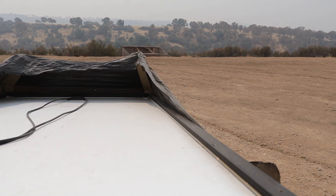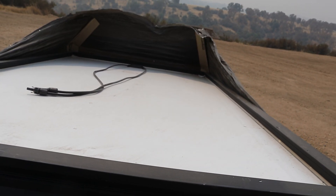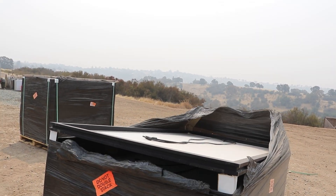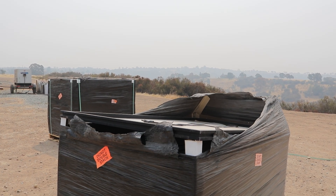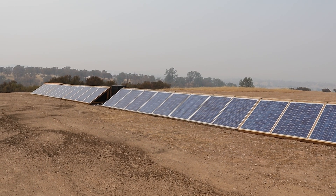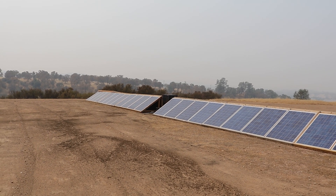To mount these, I'm just gonna drill some holes through the side and screw into the wood. I've got another charge controller on the way, as well as a couple of combiner boxes. This will bring us up to a total of 96 panels on this system. It'll be quite nice once we have these all hooked up, because we'll have somewhere in the 20 to 25 kilowatt generation capacity.